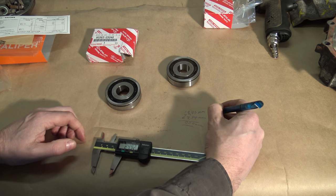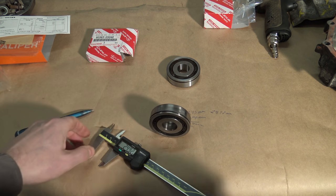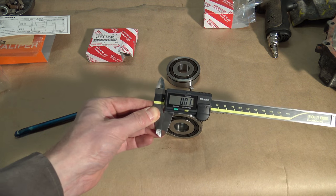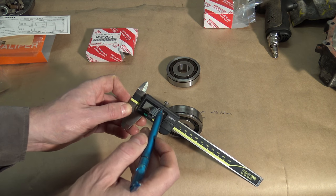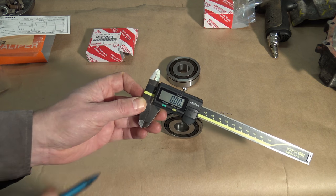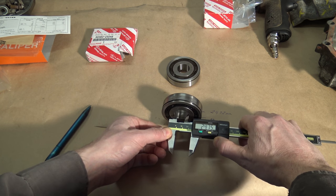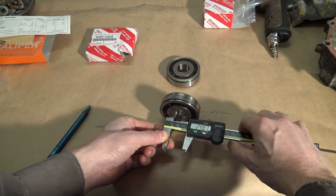and I insert this other one in here, 24.92 millimeter. Okay, and then I measure that old one, and now this old one's hole must be bigger. And I insert that at a zero position. Now we can see that there is one point of movement, so we can reset that again, so that I do this origin mark, because this is always the important thing. Okay, now it's reset, like a zero position. And then I start to measure, and let's look at what the biggest amount is.